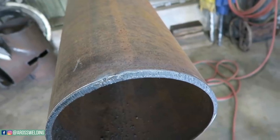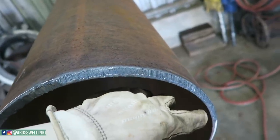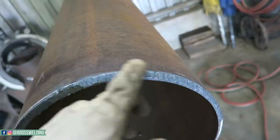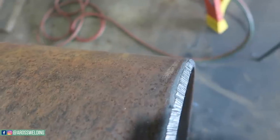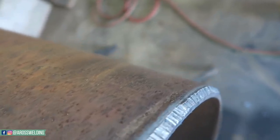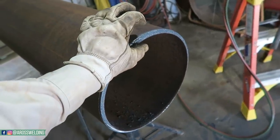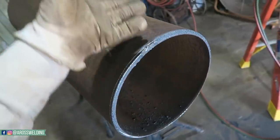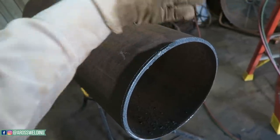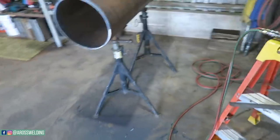That's what the torch cut looks like. I tried to leave a landing — that flat part on the end is called your landing. I left it a little thicker because I was going to come back with a sanding pad. It felt like it took about the same amount of time as the sanding pad, but I'm still having to finish it with the sanding pad. On thicker pipe — 500 wall or better — it would definitely be worth using the torch. It also gives you great practice with your hand torch, which is useful for fabrication and structural work.